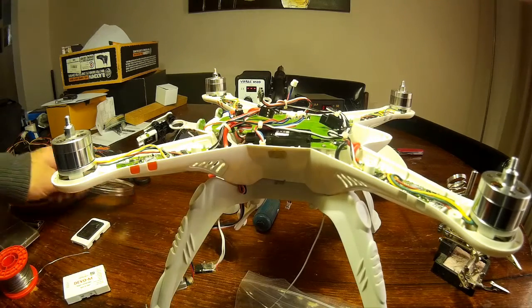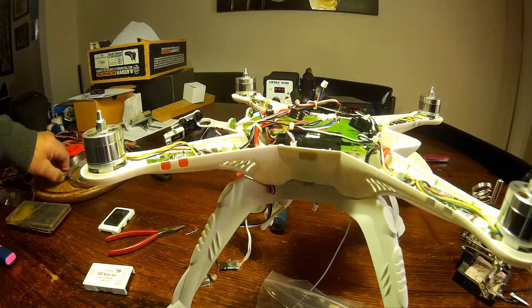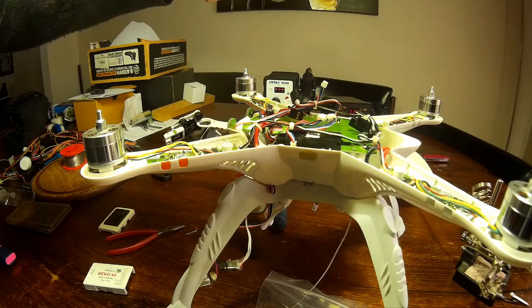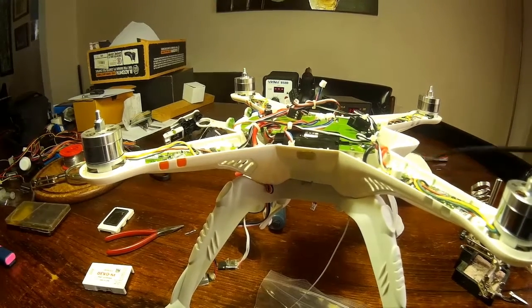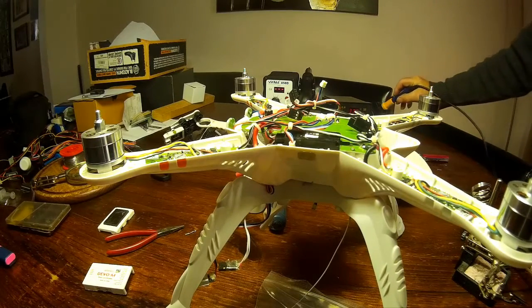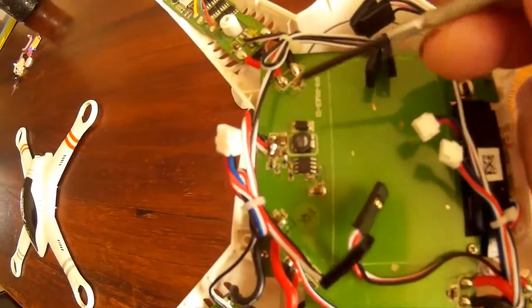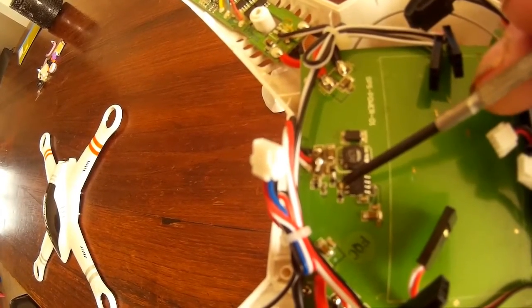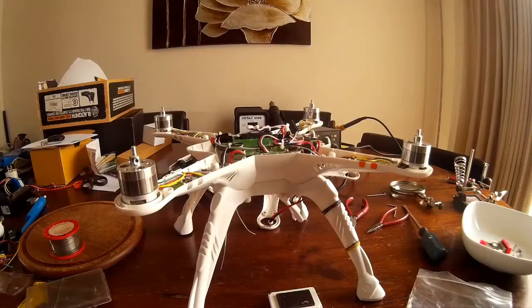Not that hard — it just saves cutting the wires and having to muck around with shrink wrap and all the rest of the nonsense. It does exactly the same job and it's a lot quicker. Having a final check to make certain I've got it right — the solder joint's nice. You can see the solder bridging between the two red and the white wire, a nice little blob in there, so definitely getting contact between the two.